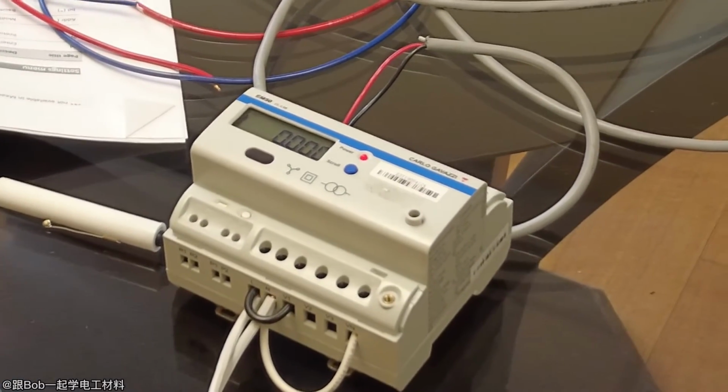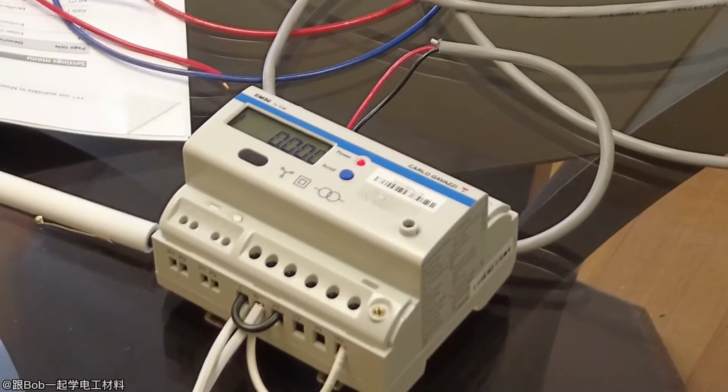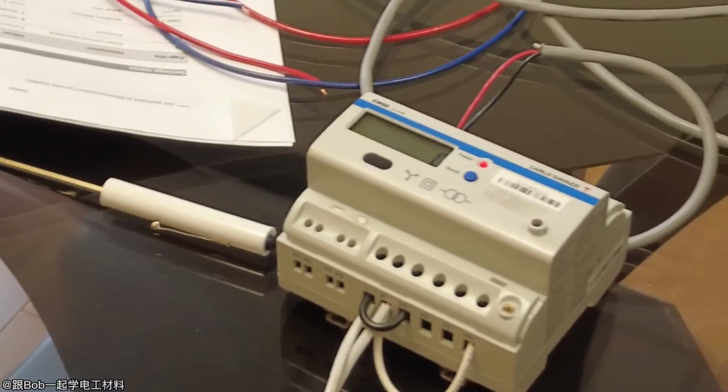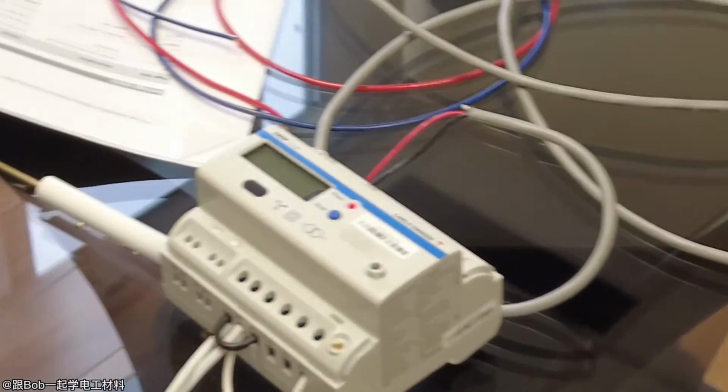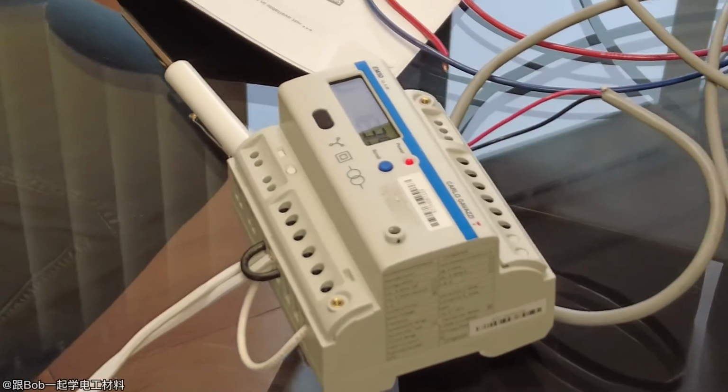Does the UWP have an interface with RJ45? No, this one doesn't use Ethernet. This is strictly Modbus, and BACnet, but only RS485. If you want BACnet or Modbus TCP, which is Ethernet, then it would be a different meter we would give you.